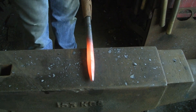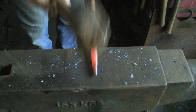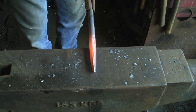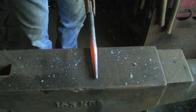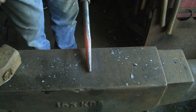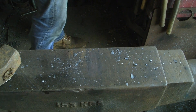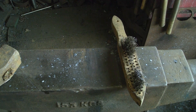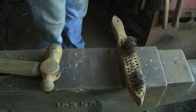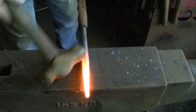Now I've got it that far, you can start knocking off the corners because we're basically to the size we want. Just knock off the corners, keep squaring it up, then slightly on the next corner - because each time you put a flat on it you're putting another little corner on it, so just keep moving it around. You don't have to go mad with your hammer. That looks quite rough but that's perfect - that'll come up nice with a lighter hammer. So I think we'll probably go on to the lighter hammer now.